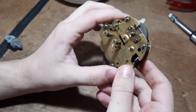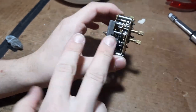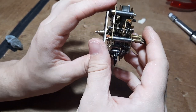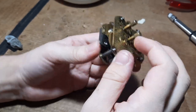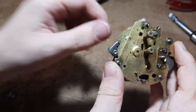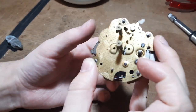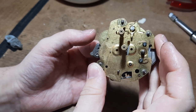If you look around you will see the movement - it's constructed from two brass plates, which is like a sandwich, and inside it are all of these wheels and gears and stuff like that. Now at the end of these wheels and gears, they are mounted on axles, and at the ends of the axles we have what are called pivots. If you look you will see these points where the pivots protrude through the plates through these holes called pivot holes, and these holes keep everything aligned and provide the structure to the movement.